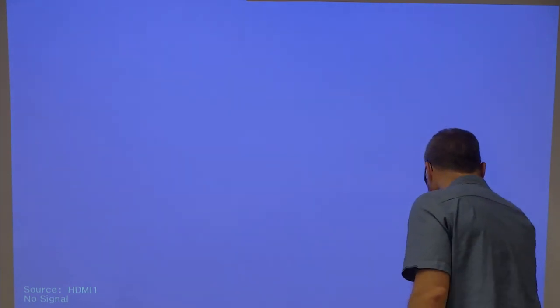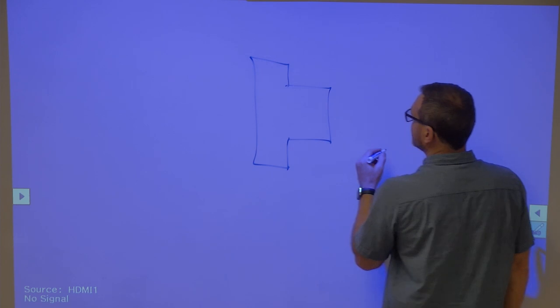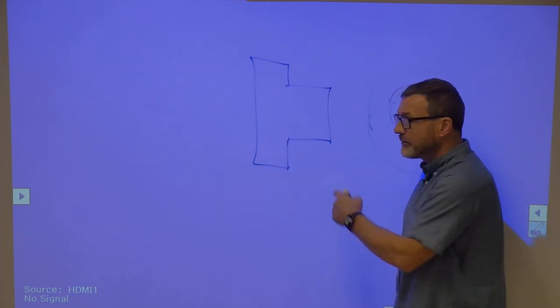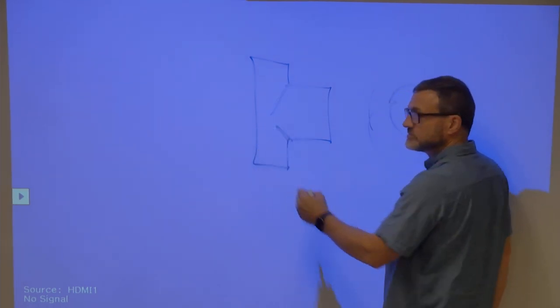But you're responsible for the stuff that you do, the stuff that you weld, the stuff that you machine, the stuff that you put together. So if you have a piece of 4140, and let's just say we're building a round part. Side view of the round part is like this. So it's got a step on it. Front view of it might look like this. If I have a part like this and I send it to heat treat, I can almost guarantee if a crack were to form, it'll form right here.